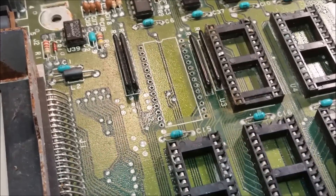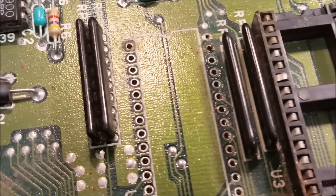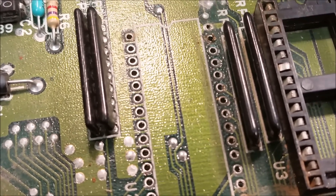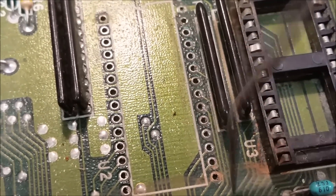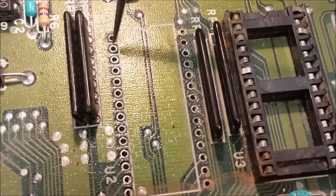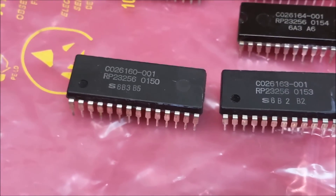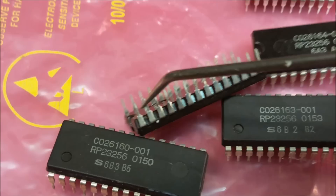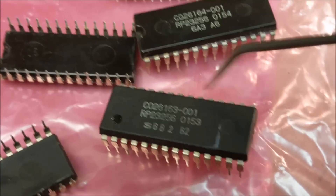Let me go have a look here. Yeah, it looks like I have to clean them up a little bit. There's a little bit of corrosion on the board — soda pop or something, not sure what it is. I'll go ahead and remove the other five, then clean all the holes up, put some solder flux on them, re-tin them, make sure all the barrels are clean, then drop in the new DIP sockets and reinstall the chips. I'll clean up the corroded pins with a blade and reflow them.